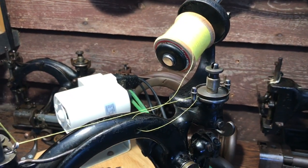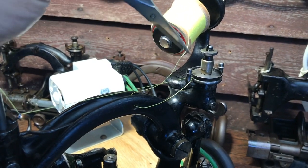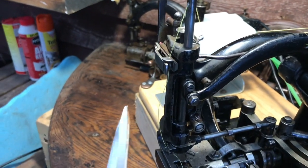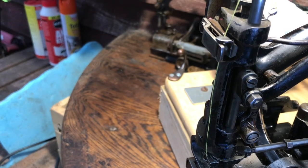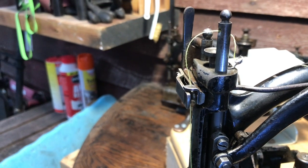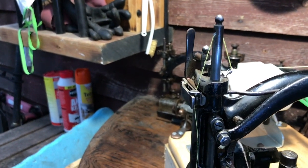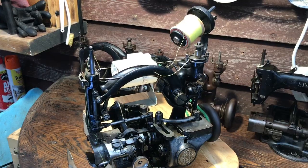The machine is pretty much standard — the thread comes down through the arm, then round the tension unit, then across to the bottom guide, up through the needle bar. The important thing is it must go just in between these two plates there, because as the machine turns you'll see a little plunger close that up, and then as the machine turns more it releases it — so that spring opens and closes, and that's really important.